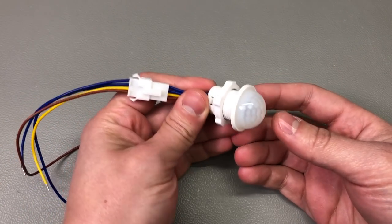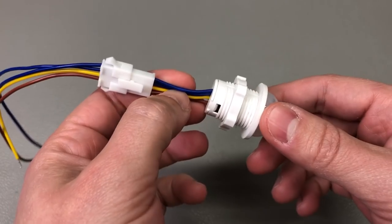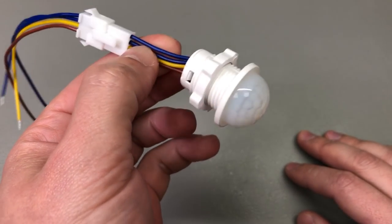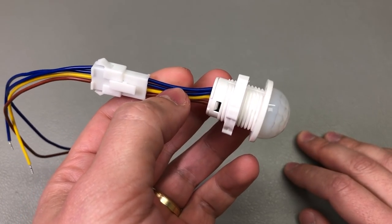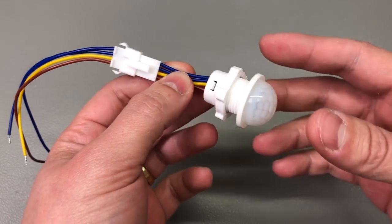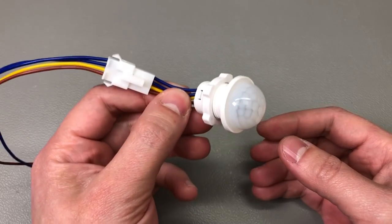Next up I got another one of these small panel mount PIR sensors. The circuitry inside is very simple — something like a capacitor divider to provide power to the PIR sensor, and then the output from the PIR is used to trigger a triac. My goal here is to use one of these as a switch input to a smart relay flashed with Tasmota, so I would end up with a motion-activated relay that I could also use to control a light, while having the smarts to control it over MQTT and add other factors like ambient light level or varying the on-time.